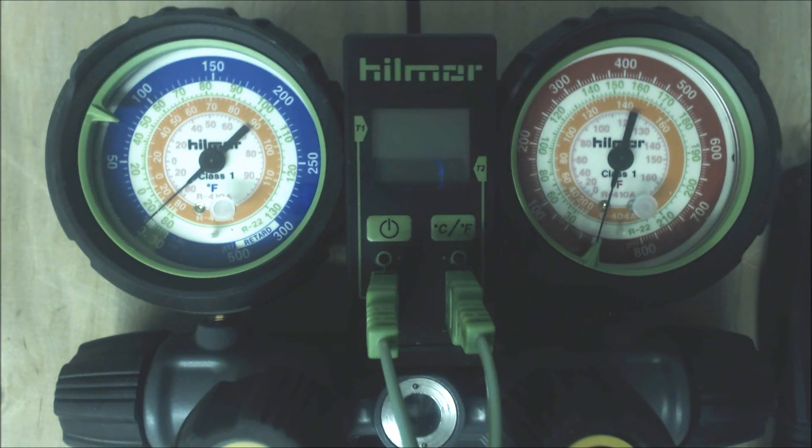At the same time, get an outdoor temperature — about one foot away from the outdoor coil, down low, closer to the ground, in the shade, out of the sun, and nowhere near the top where heat is being rejected by the outdoor unit. You want a true outdoor temperature. Once you have your wet bulb inside temp and your outdoor dry bulb temp, compare them on a superheat chart. Say we got a wet bulb inside of 56 degrees and an outdoor temperature of 70 degrees — that gives us a target superheat of 10 degrees.